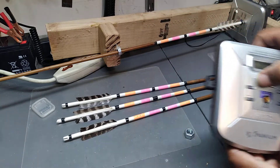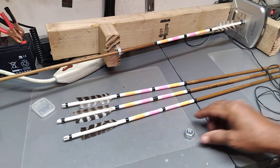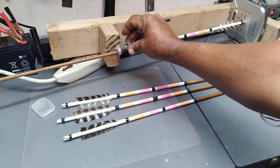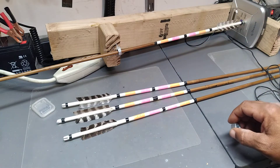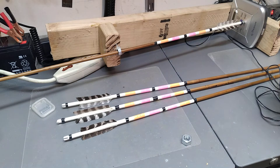Okay, that was the plan. The first part of the plan was to have a bolt like this, hot glued to a piece of wood, that would support the arrow, and the CD/DVD player would actually spin. The problem with that was the friction — since the DVD/CD player doesn't have a lot of torque, when the arrow was placed there, it didn't have enough torque to spin the arrow because of the friction on the hole. So I had to make an adjustment there.